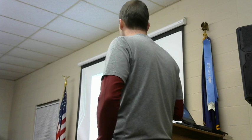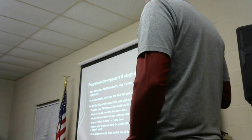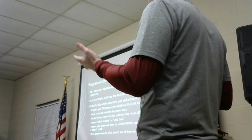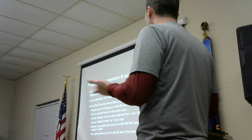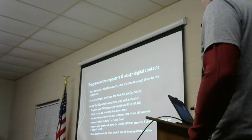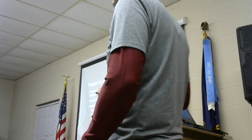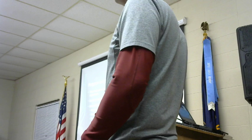And we kind of talked about this already. 443.400 is the Cox South repeater frequency, so you're going to put that in as your receive frequency. 448.400 is your transmit. You're going to select the scan list and set your timeout timer. I always use a default of 3 minutes. I don't usually talk longer than that at a time, and a lot of repeaters are set to 3 minutes, which is another reason I set it to that. You're going to set your admit criteria. That's something new, we'll talk about that a little bit. Color code is kind of like setting your analog radio to CTCSS or full decode. It's not going to allow you to talk unless the color code is free, or your CTCSS is free, if you want to look at it that way.